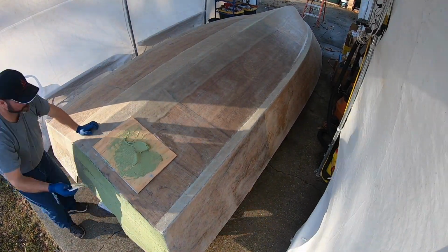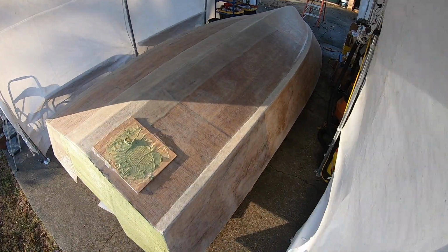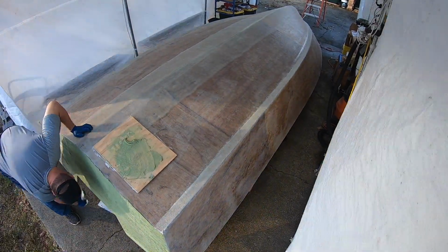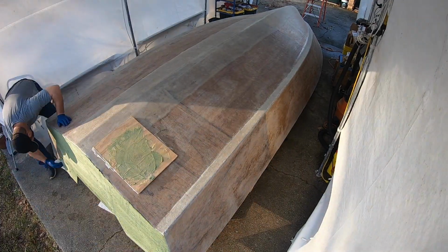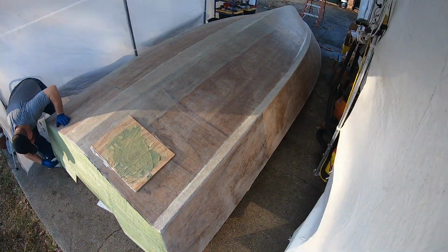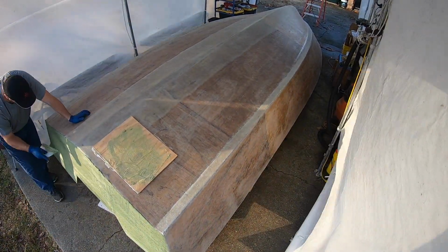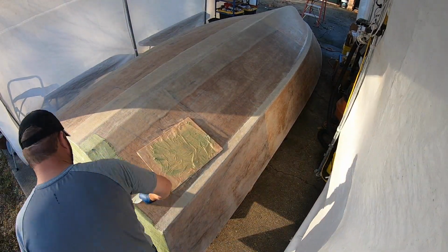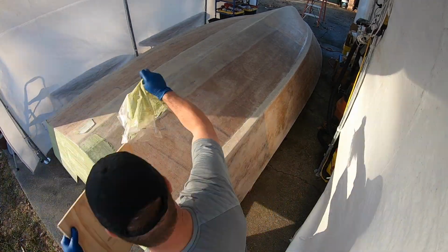But all I'm trying to do here is much like if you were laying tile, where you use a notch trowel to put the grout on the floor or the wall or whatever. What I'm trying to do here is just pull a notched layer of that in there so that the ridges will be more pronounced, and then you'll come back and sand it, even though I'm probably going to sand 90% of this stuff off. But the whole point is once you do this, you should be pretty close to being ready to get to finish primer and stuff like that.